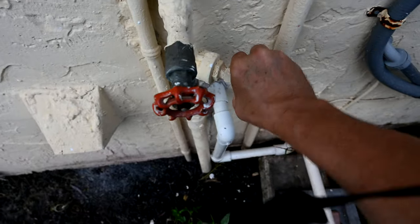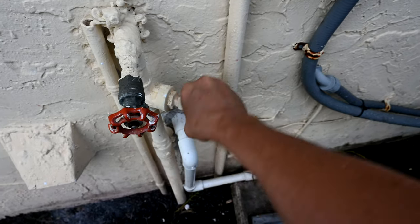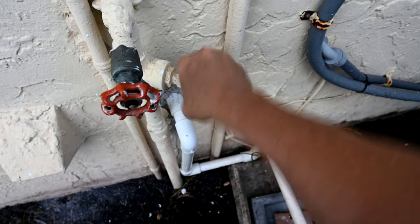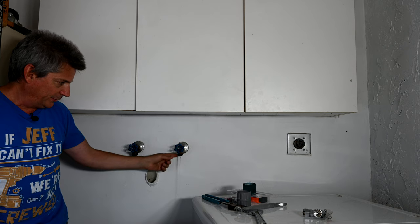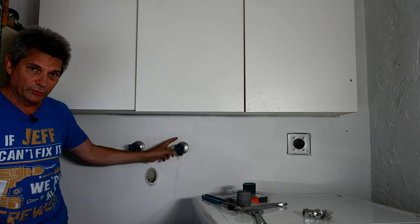Here's the main cutoff. We've completed step one — we've turned off the water outside. We've disconnected the hoses. Now step two is you want to open both valves all the way and let all the water drain out, because if there's any running water at all, even just drips, you will not be able to melt the solder enough for the valve to come loose when you go to torch it.